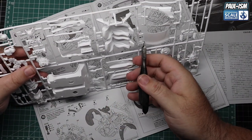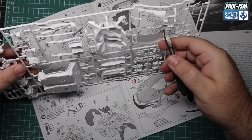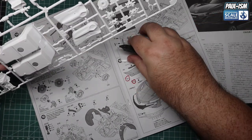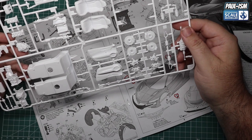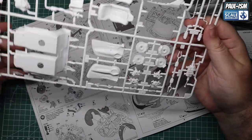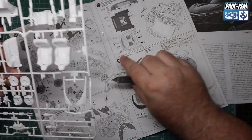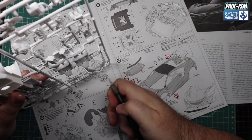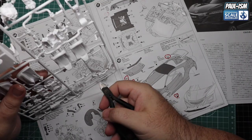So we're going to cut a few parts off. These are all body panels. Like I say, these either need attaching now. If we can get away with putting them on, we will, because it helps with the color match. Or if they need to be separate, we'll mount them and spray them as we go. Now, luckily, with some careful checking with the side panels and what have you, we're only going to have the body and the wing mirrors as two separate components to paint. And it makes life a lot easier and makes sure the color match is right throughout the build as well.